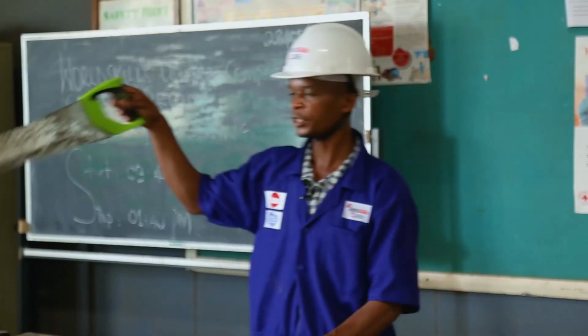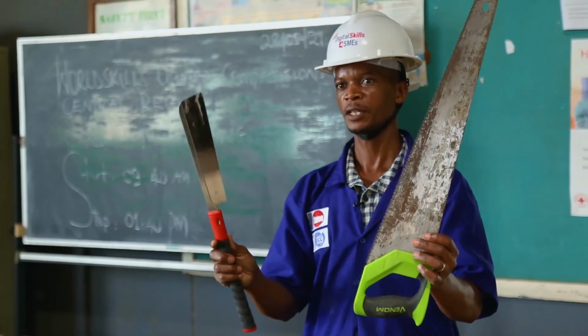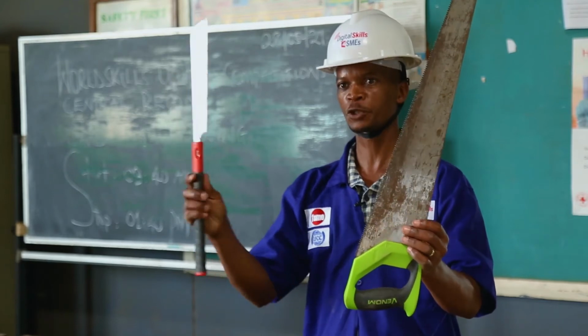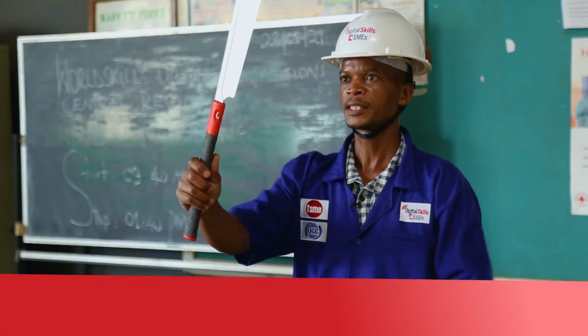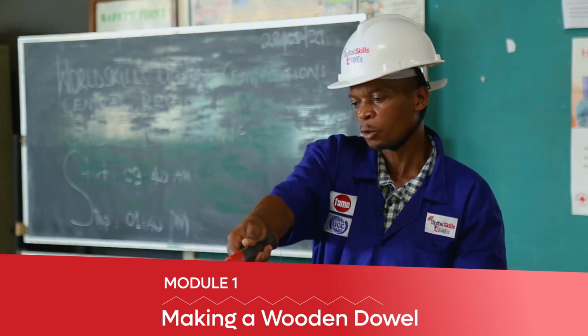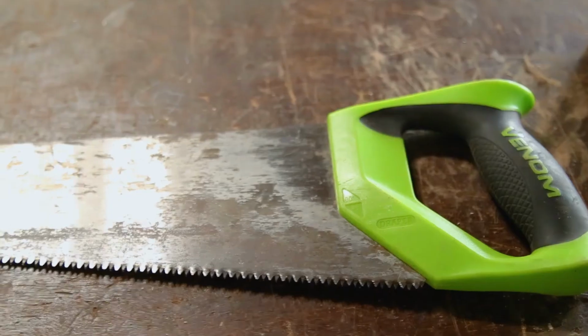Members, you should be having this on board, but this is, like I said, I talked about technology. You can see the formulation, the shapes of this saw and this one. With this saw, you use back and forth strokes to cut something. But with the Japanese saw, the teeth are arranged so that you should be pulling more on your side, on the chest side, than pushing it.